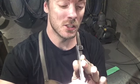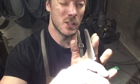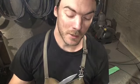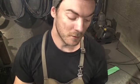But just having that little bit, we're talking thousandths of an inch off the edge of the belt a little bit like that, now you're grinding up the face of the bevel a little bit. And like I say, this is all about mileage. You can't get better without practicing this. Grind a lot of bevels.